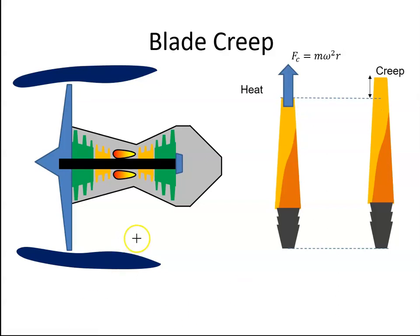When that is said to have occurred, we have what is called creep. Creep has a limit. If the blade was originally at a certain height and has now, due to expansion, crept up to a greater height, then there is the chance that the blade will rub against the casing. That would cause damage and is an unsafe condition.